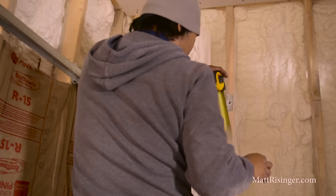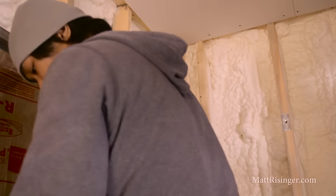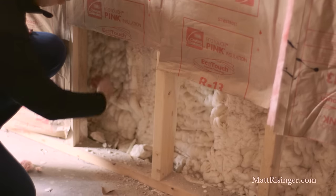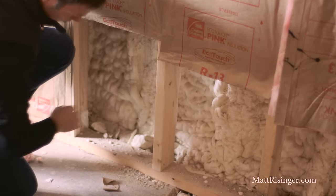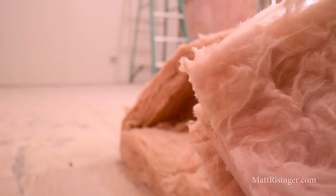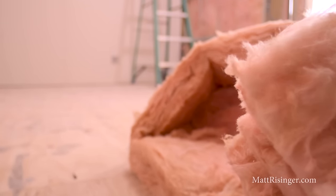You can see we've got our insulation up. We've got two layers — two walls. We've got an exterior wall that's sealed with a good foam insulation, making sure it's a good airtight envelope. Then we've framed a floating inside wall that's insulated with a batting insulation. That adds a different type of sound absorption than the foam does, so we get a wider spectrum of effect.